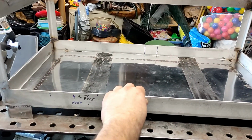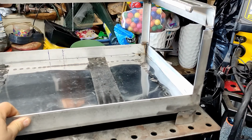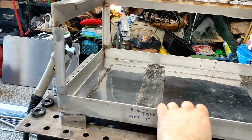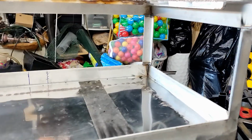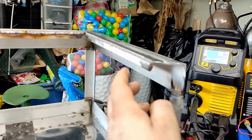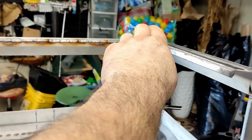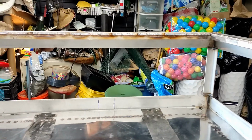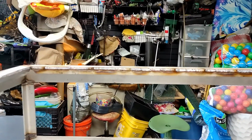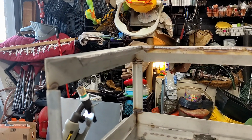It doesn't shake. I wonder if I was able to keep it from warping. I had a couple of issues with warping when I turned over this edge and then started welding. So I start welding this side, then in the middle, wait a little bit, and then do it in sections to avoid this bending and warping too much.